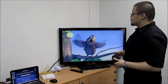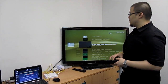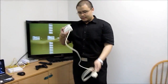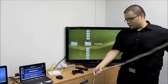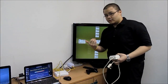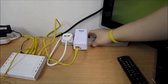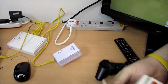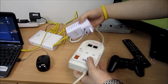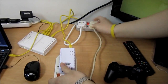Let's see what happens when we ignore more impractical restrictions by adding a surge protection device. I'm going to stop this stream and include a generic surge protection device. The first thing I'm going to do is turn off the power supply for the powerline adapter, remove it, and include the plug for the generic SPD onto the power strip. Then I'll connect the gigabit powerline adapter onto the SPD, and turn the power supply back on.